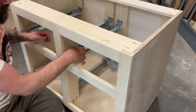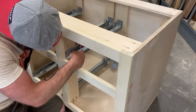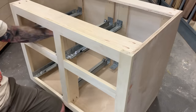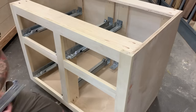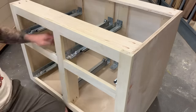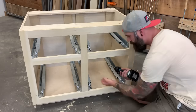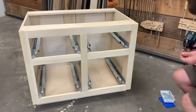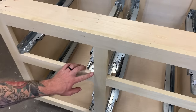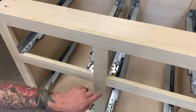You can see where the drawer slide would sit for an over-mount, but we want it set back enough for the drawer face to sit internally inside the face frame. We hold each drawer slide in place with one small cabinet screw, lining them up perfectly with the front lip of the face frame. And that's it — all of our drawer slides are installed: over-mount on the left, inset on the right.